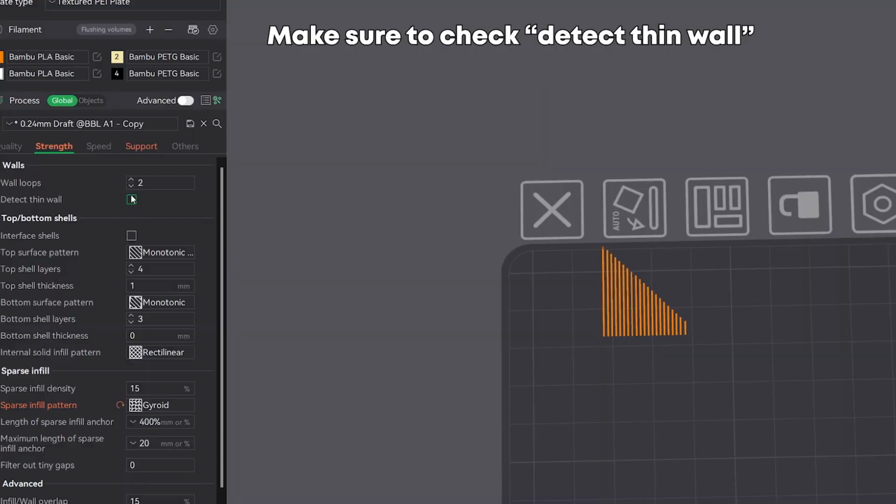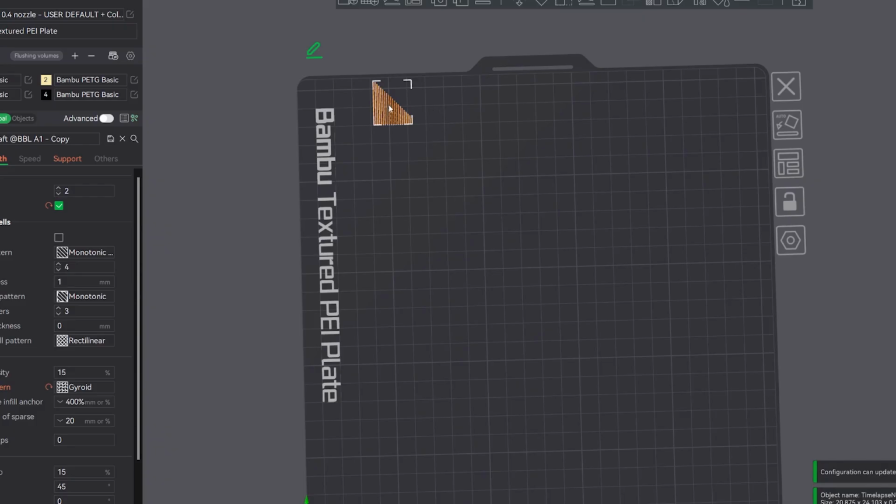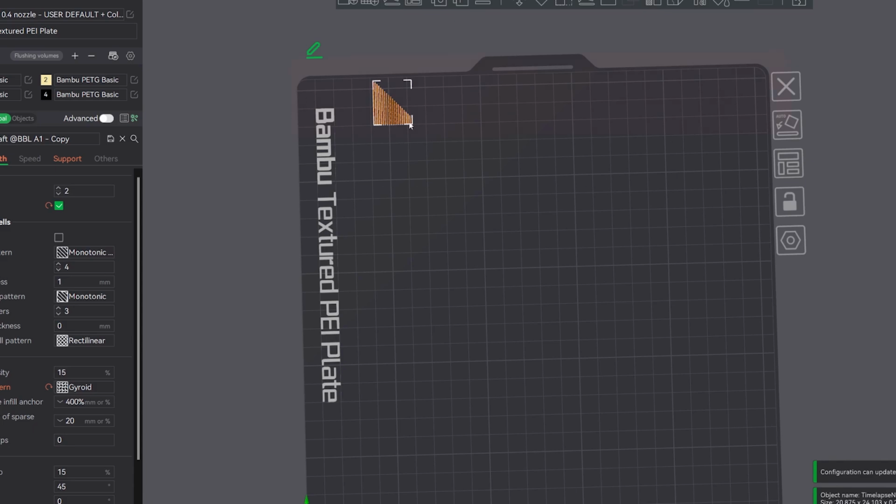The other thing to note is that you basically need to keep the back of your print bed free from any models or purge towers. This is because it will end up triggering the sensor multiple times when you don't want it to. I actually have another test file you can use to really tune in how many millimeters you have to play with. Essentially, just see when your camera starts taking pictures and then remove that many millimeters from the end of your print bed, if that makes sense. You end up essentially creating a no-go zone on your print bed.